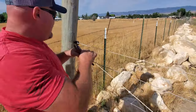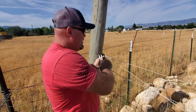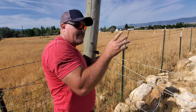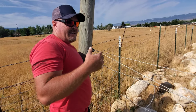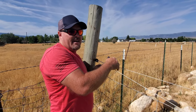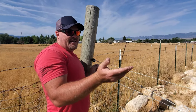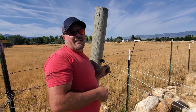The main things you need to know about electric fence: you've got to have a good ground or else it's not going to work. This can go up to 20 miles. I've got a battery and it's plugged into AC — an AC to DC charger which charges the battery — so your batteries are never going to die as long as you've got AC power. You can also get the solar ones; they work pretty good. Like this one, it can go up to 20 miles.